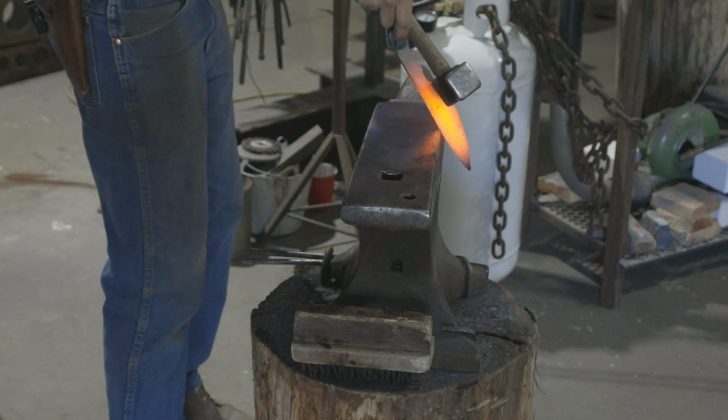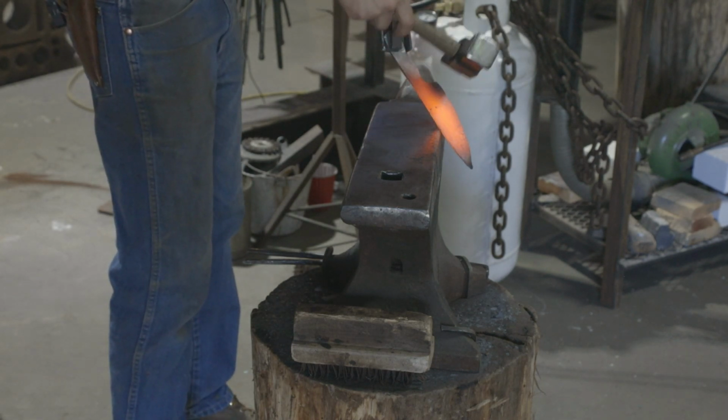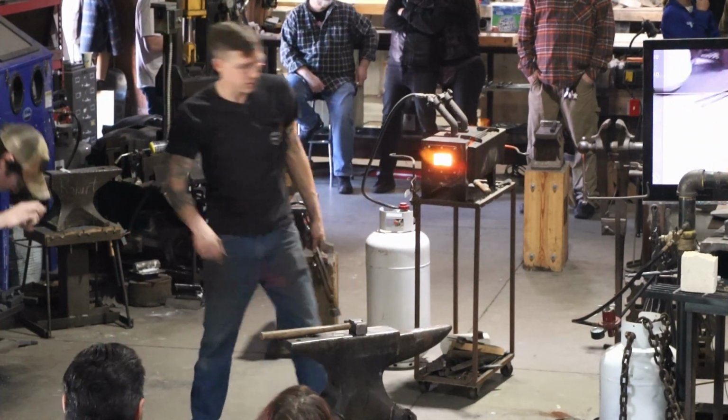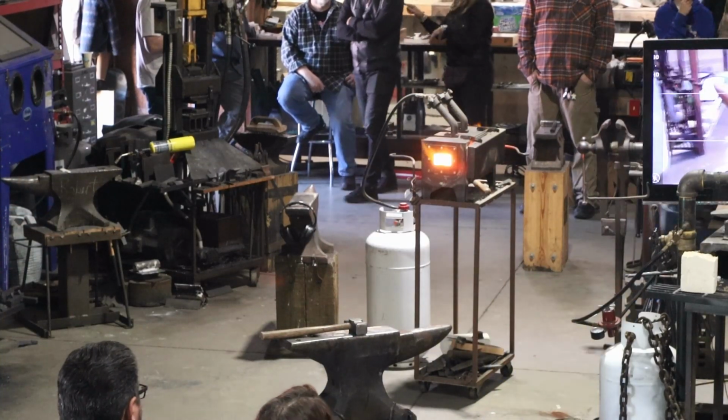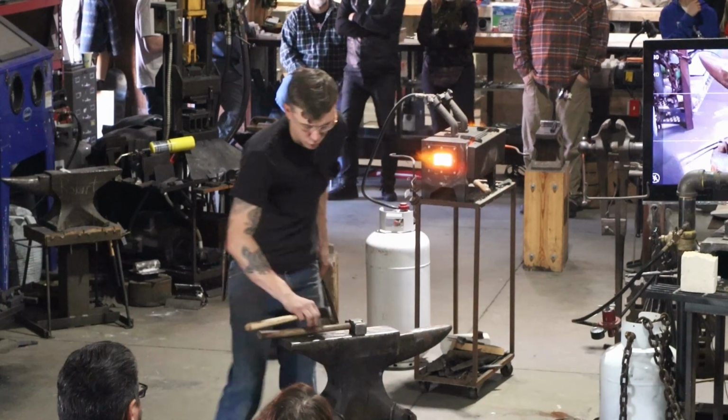So I'm forging right in through here, to only push it out that way and a little bit backwards. And I'm just pinching away there, so I can really be selective about where I do that. Let me get a, that's not the right. Might be easier with a standard cross peen.